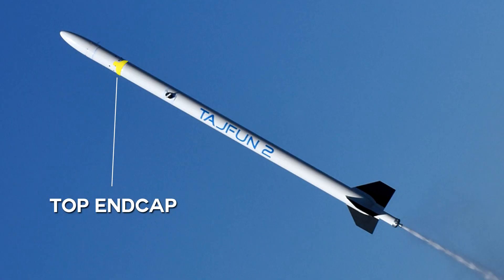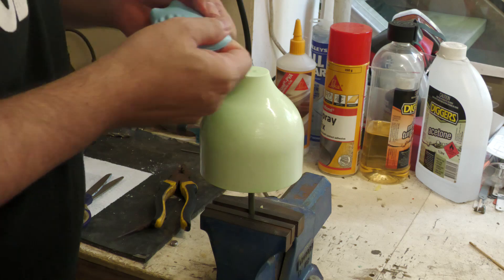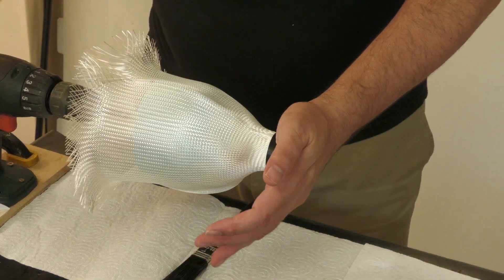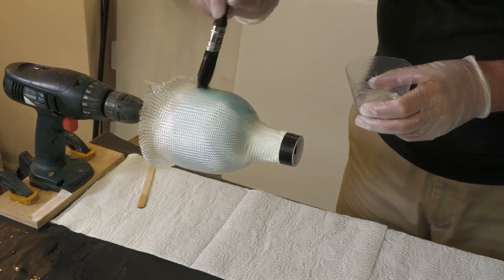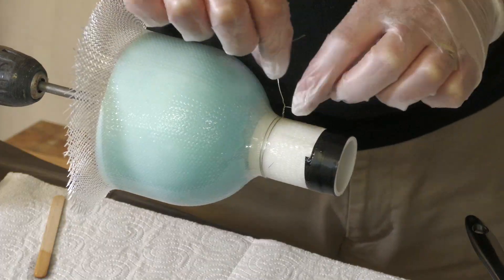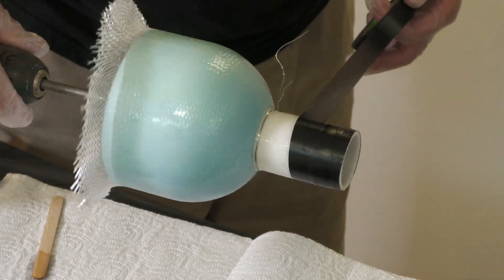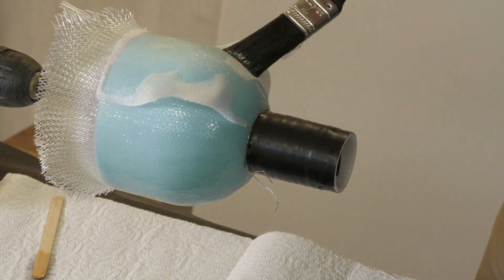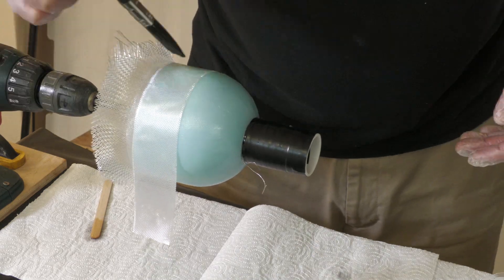To seal the top of the pressure chamber we make a top end cap, made the same way as in other builds. We start with a 3D printed mold and cover it with a couple of balloons, putting a super light coat of silicone grease on the balloon before applying the fiberglass sleeve. Without grease the balloon sticks to the epoxy and makes it much more difficult to remove — but you don't want too much grease because you want a good bond for the internal reinforcing that comes later. We compress the end of the sleeve with tape to drive out air bubbles near the transition, then put a thin layer of fiberglass to smooth the coarser sleeve and prevent any micro holes through the walls. The last layer at the base of the cap ensures a snug fit inside the main body tube.